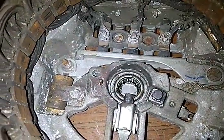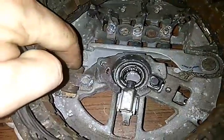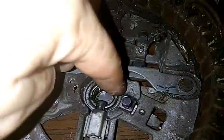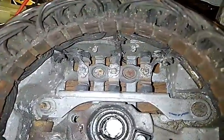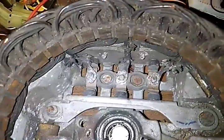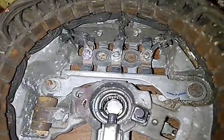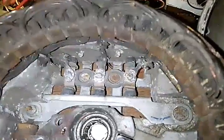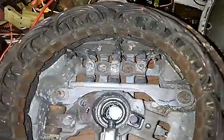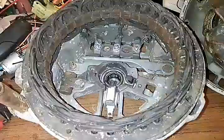Your alternator ever goes out, it can either be this capacitor, these brushes, or these diodes. And these diodes, I don't think it's possible for you, unless you just tore them up, or, I don't know how you could tear those up, honestly. Feeding power into it backwards until it smokes or something. Nah, I don't know. Anyways, I don't want to spend all day on this. Just trying to make you a short video real quick.